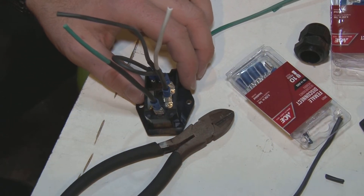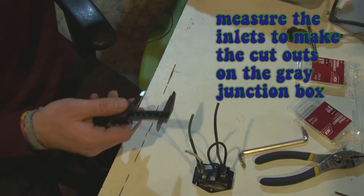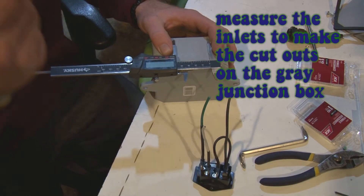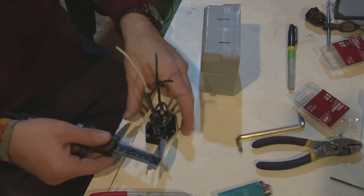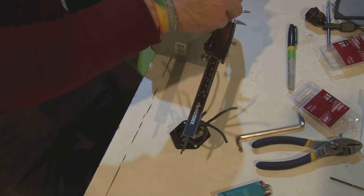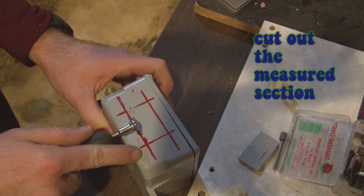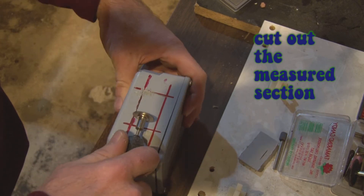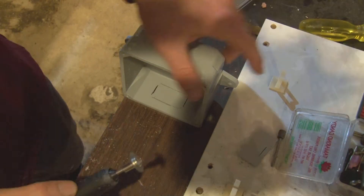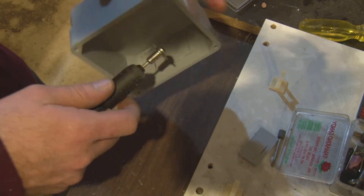Now let's measure out the size and draw it onto the project boxes so we know what size piece we're cutting out. We want to do it exactly so it's nice and clean, fits snug — it will be drilled in, so wiggling isn't a concern, but I don't want gaps on the outside looking ugly. I want something that looks nice, clean, and professionally done. I had a Dremel available but didn't love it — the round blade meant I had to go extra far into corners, which gouged out a little extra line. It looks a bit shabby. Next time I'll find a tool that's better at cutting perfect squares.